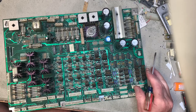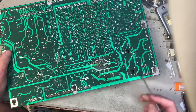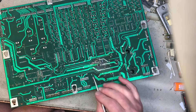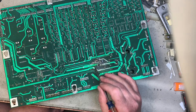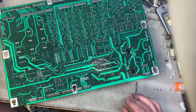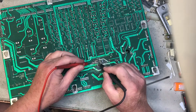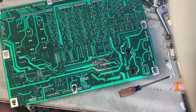They never did get to the reset problem, but they did make a go of hacking things up on the back side of the board. They implemented what we have in the pin wiki as step 42 — the 'when all else fails' fix — placing a resistor in series with the output of the LM323K. Let me see what value resistor they used for this hack — a 24 or 25 ohm resistor.